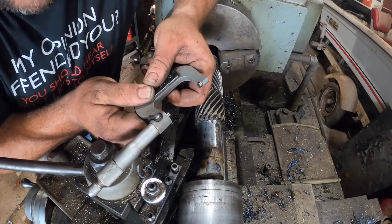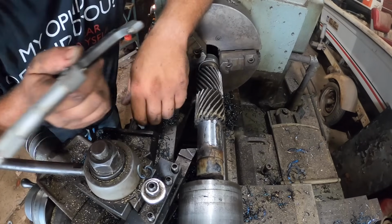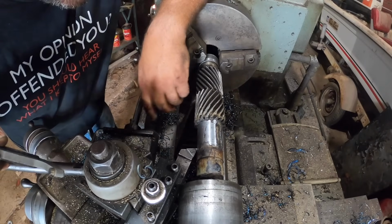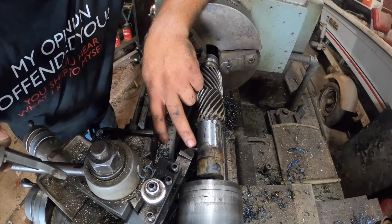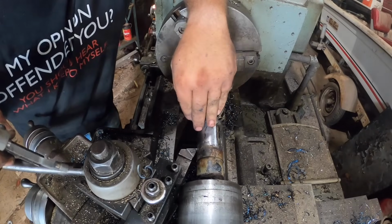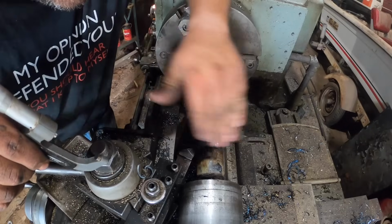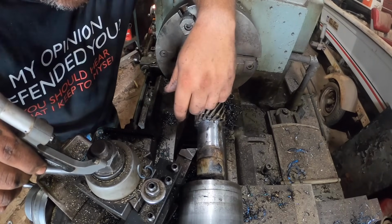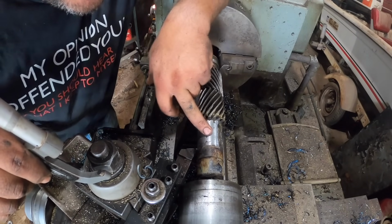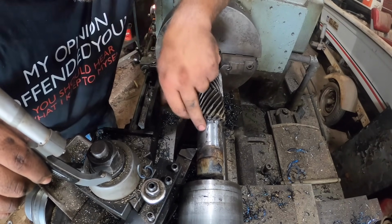So right now I'm sitting at 1 inch 905, and so 880 to 905 would be 25 more thousandths. I was wanting about 30. We'll split the last cut up here into 3 cuts. The next cut I'll take 10 thousandths, and then we'll measure it, see where we're at, and we'll split that in half. By taking 3 cuts at the end of roughly the same amount, the load in this tool, or the springiness, if you would, of this machine will be somewhat equal. That'll give us a better chance of hitting exactly where we want to go. I'll actually shoot for about 1/1000th bigger, for about 881, and then we'll sand off that last thousandth to get us right where we need to be.